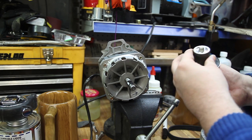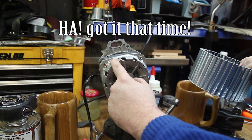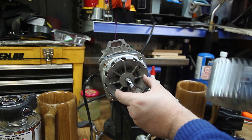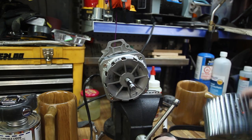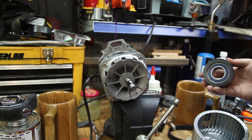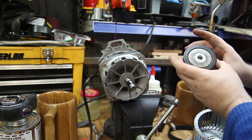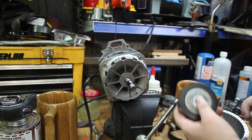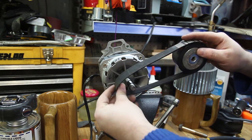Unfortunately we don't have the right pulley — this wants to run at about 3,000 RPM but the motor runs at 1,700 RPM. I did the quick math: the pulley it came with was a 2-inch pulley; we would need a 4-inch pulley on here to get to about 3,000 RPM, give or take. So what we're going to do is mount a two-and-three-quarter inch pulley here and about an inch-and-a-half pulley there, and instead of using the V-belt that it comes with, we're going to use a splined belt that comes from a treadmill.